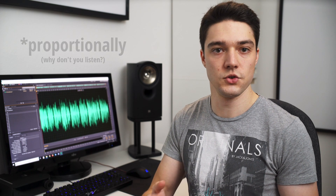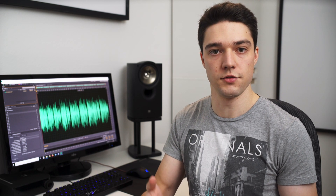I think you now understand why this is not helping. But so far, turning down your gain and turning it up in post didn't change your noise floor at all — so how could this possibly make things worse? Well, there are primarily two things. First of all, remember when I said that the noise and the gain of the preamplifier scale linearly? This is usually only true at middle to high gain settings of a preamp. At lower gain settings, it starts to behave differently — the noise and the gain behave non-linearly.